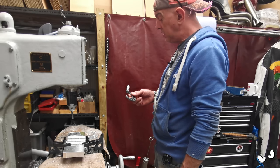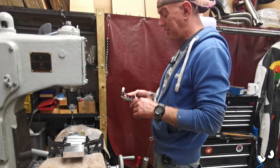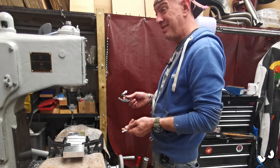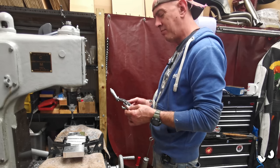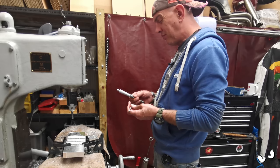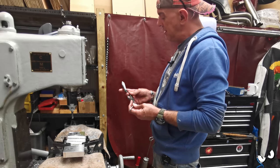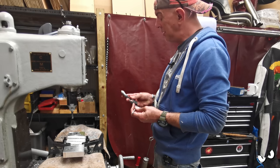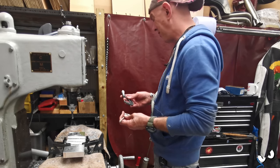What I think I'm probably going to do, I ain't going to show you. But these micrometers aren't amazing. They only go down to two decimal places. But I figured, well, you're starting out, you don't need the extra decimal place. But I'm getting quite good. It does take practice. And I'm still measuring things several times, just feeling for it and everything else, until I'm happy with the measurement that I've got. I don't think I'm ever going to need the extra decimal place, but once I get to the point of noticing, then I'll consider getting a set. In the meanwhile, 1/100th of a millimetre is probably good enough for me, I think.